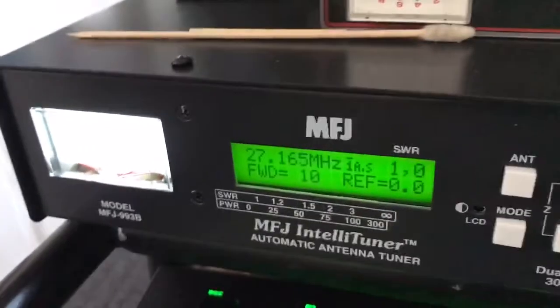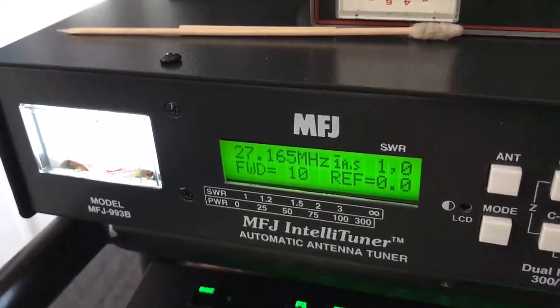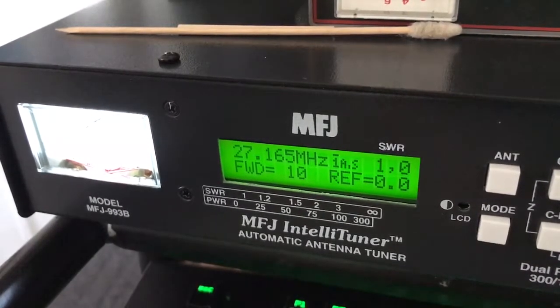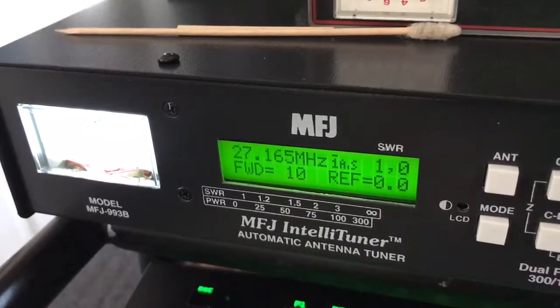That can be a valuable thing for you guys if you want to use the tuners. I know without the tuner in line I get a very good SWR on the AM 40 channels for 11 meters. I like to extend my antenna up into 10 meters because I talk there as well. I kind of tuned my antenna a little differently where it's still acceptable, but a tuner definitely helps.